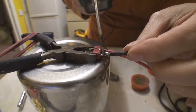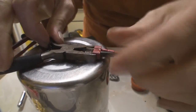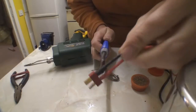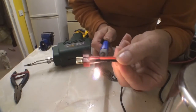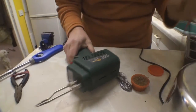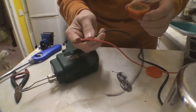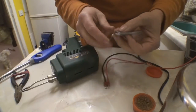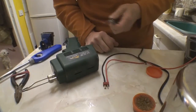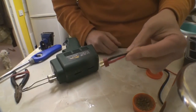So basically you need a decent high-powered soldering iron. Make sure everything's clean, put some flux on, and use good quality solder — the cheap stuff is very hard to work with. Invest in some decent stuff and you should be okay. It should be as easy as that.